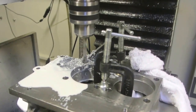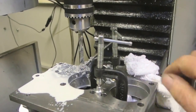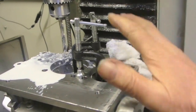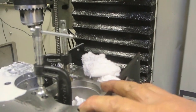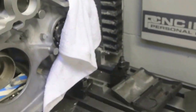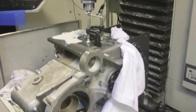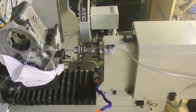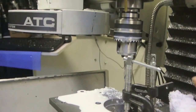That's the first hole almost finished. I'm programming these to finish each hole individually, using this as my guide. This fixture I made earlier allows me to spot drill through from here. It took quite a bit of making from steel. The setup is really quite awkward — it's a big piece of metal. If I stand back you can see how much room it takes on the mill; we're almost at the maximum height we can work at, but there's enough room to drill the tapping size drill.